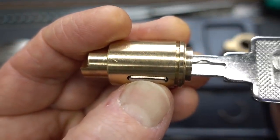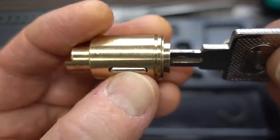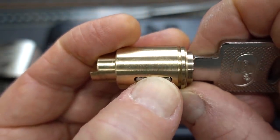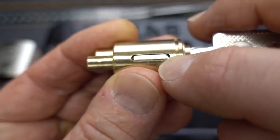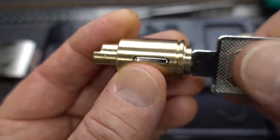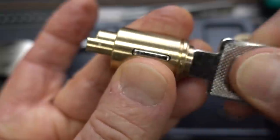And you notice as I rotate them, nothing really happens. Doesn't go into the body. Now, if I slide the key all the way in, again, I'll try to hold this and slide him all the way in, you can see that he does go down inside of the body, and this is where it gets weird. Now, what happens is, that slid in far enough to bind the inner core to the middle sleeve so that the entire thing is now held together by that locking bar and the whole thing turns.